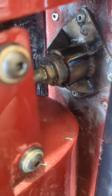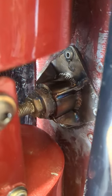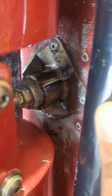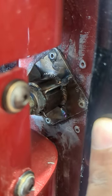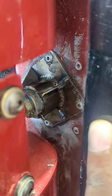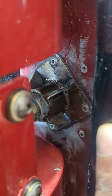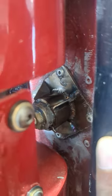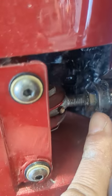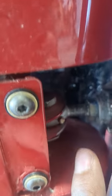There will be structural glue all over the place. Make sure the structural glue does not go in the hole where the threads are — you can put blue tape on it so no glue gets in there. Apply glue basically all across, slide it all the way back, and let it sit. After it sets for about an hour, use your number 25 drill bit to mark and drill through the holes already in the outer plate into the back side plate. Then use your pop rivet gun to install the Cherry Max rivets that come with the safety directive kit. Then put the rod end and jam nut back, tightening to the original length and number of threads.